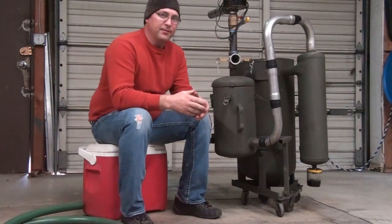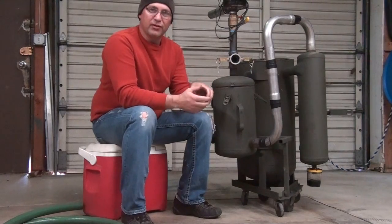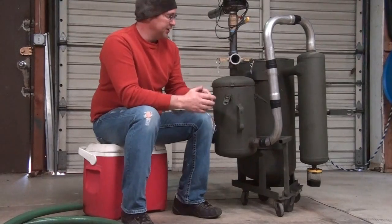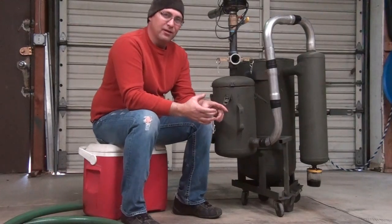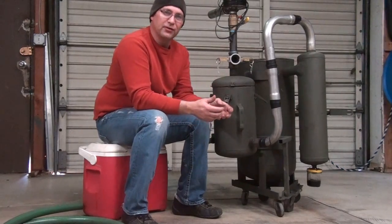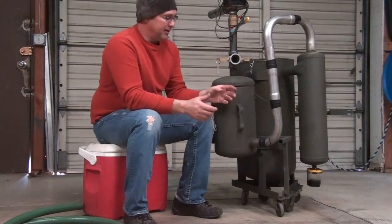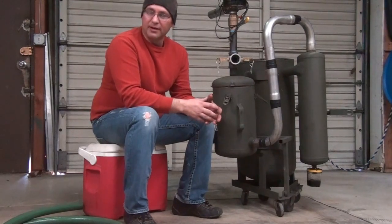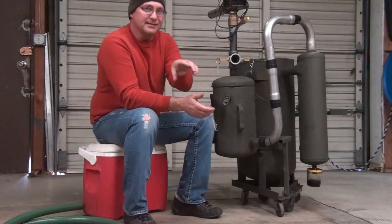You don't really need to make a major modification to the generator. In Josh's video it tells you to just plug it directly into the breather on your generator or whatever you're running. One thing I found is I have a very new generator and it has a weird plate in front of the carburetor, so I actually had to remove that plate and remove the filter to get it to work right. I siliconed some gaps to make sure it was airtight, and then it works great. No other modifications needed beyond making sure there's easy airflow so the gases can get to the carburetor.